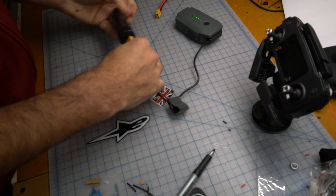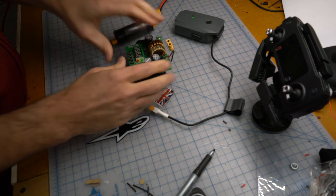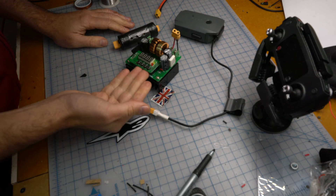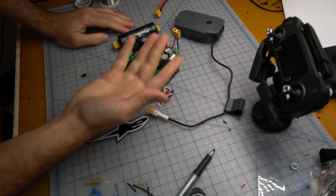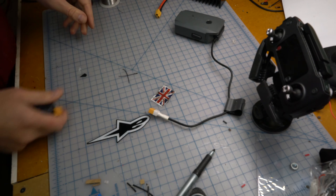Now I've done other videos on this. You could use something like this - if you've got a bit more space put it in a box. These are only like $20-$25 and they're more versatile; you can change the voltage a lot. But it's still only a step-up converter, so this will work when the ignition's off from 12 volts or any battery below 13.1 volts.